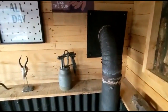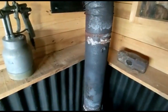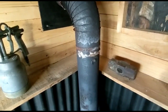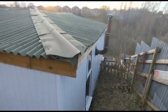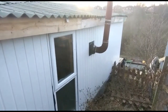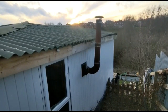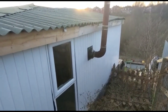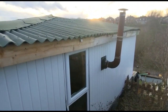We'll just go and have a quick look outside. That's normally fastened up against the wall just to keep it there tight and make sure nothing comes in from the outside. You can see it's getting a little bit rusty — this is just the exhaust putty we've used to seal up the actual pipe itself. And there's the outside of the shed — you can see the chimney coming up. You can see that twin flue just outside and the bend that comes up to help with the draw. You need to have it higher than the roof, which helps with the draw of the smoke coming out. Really really easy to fit — it took about two hours. It's a huge shed but it keeps the inside pretty warm on a cold day like this.